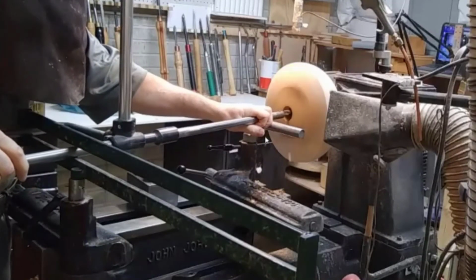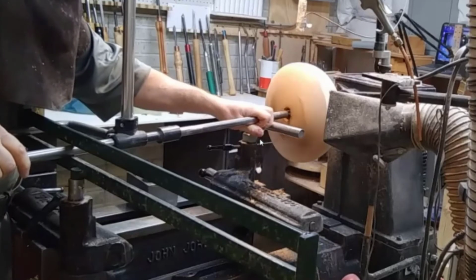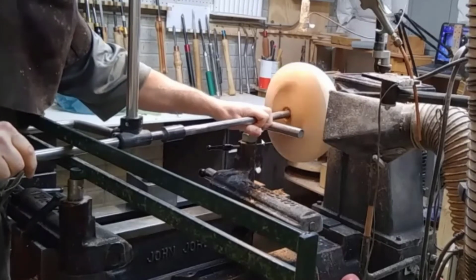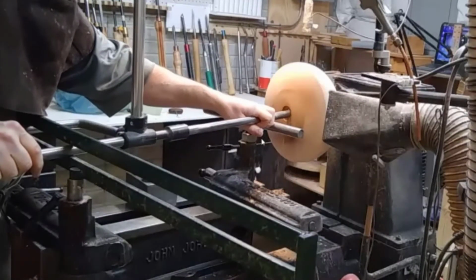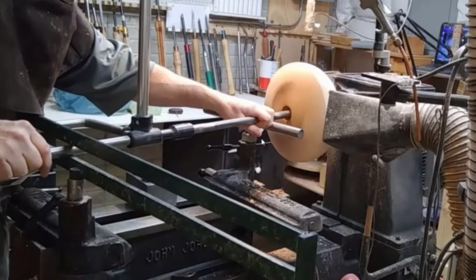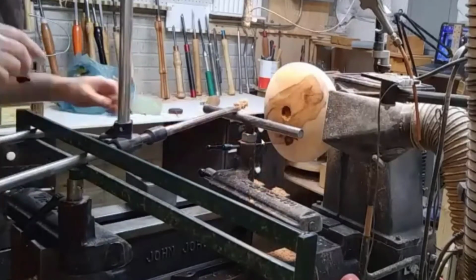Again, this should not be surprising to you at this point. All I'm doing is going in an eighth of an inch, nibbling away. I'm enlarging the central hole in a cone shape, getting rid of all that material in the center part. Now there's very little vibration here, which is good, but that's because number one, I'm only off the tool rest 4 inches, and I'm not in a situation where there's very much torque. I'm too close to the spindle axis to get torque.